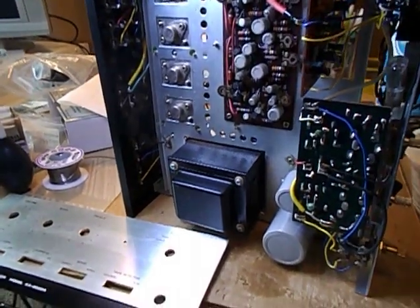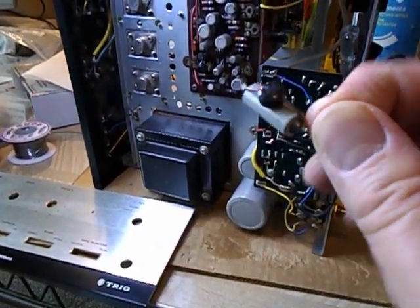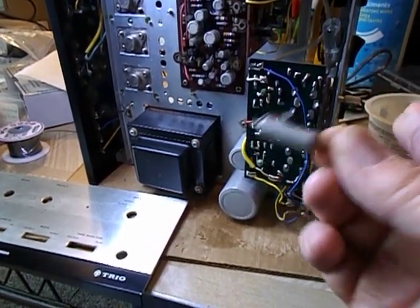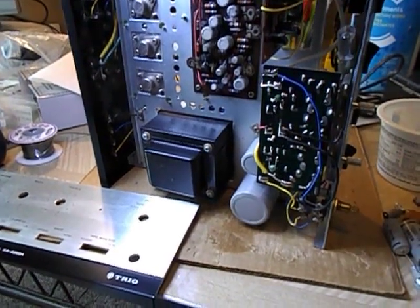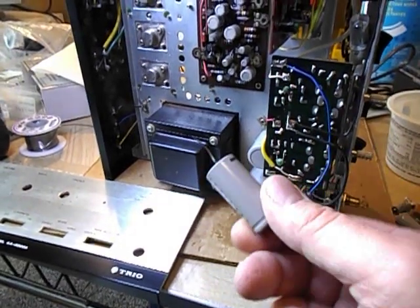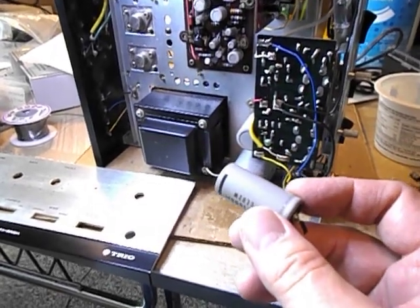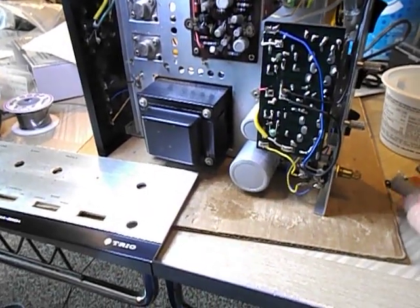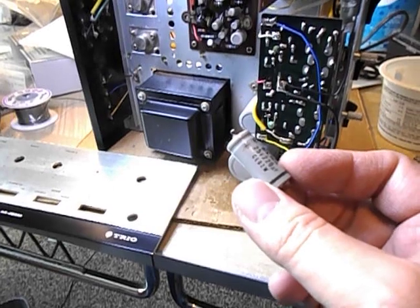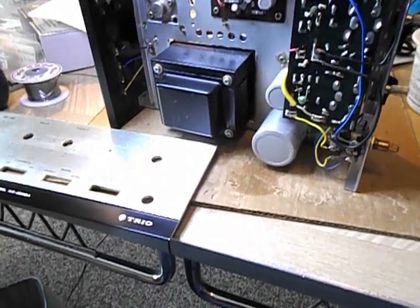Let's show you some of the stuff I've changed in here. I changed the rectifier capacitors — it's like a little gimmick they made with the rectifier, capacitor, and the full-wave rectifier. These are sort of oozing; they're oil-filled caps, and I think they're actually toxic too. I noticed the coupling caps for the speakers had quite a bit of leakage when I tested them — more than acceptable. And this one in the power supply is the filter that goes to the phono section — it's a 220 microfarad cap that was testing around 70 microfarad. It wasn't doing too good.